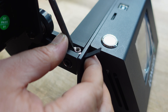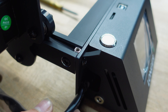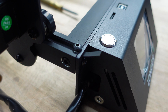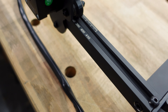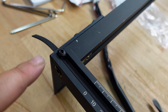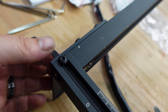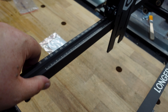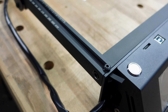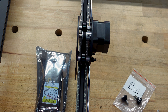Once turned, that holds the belt down in place. Then put the screw in to lock it. Keep running the belt and do the same thing on the other side. It's a bit tedious but effective — there are small holes in the side plates so you can pull the belt tight, lock it down, and get good belt tension. They also have a guide on the micro SD card if you want more instruction on running the belts.